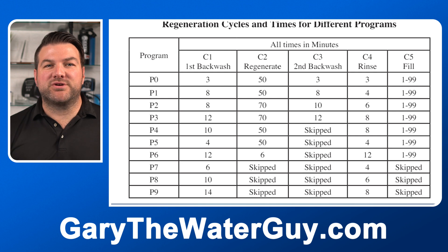Generally, unless water usage is a major concern, we suggest using P9 and setting the valve to automatically regenerate every five days. From the service mode, press the Set Hour and the Up button simultaneously for three seconds and then release. You'll need to do this twice.